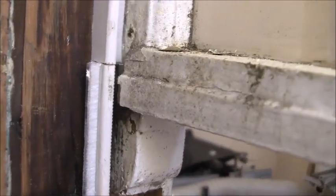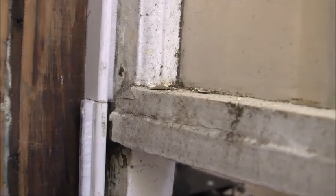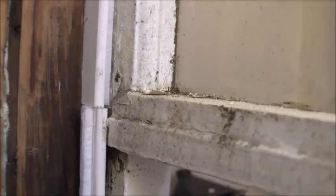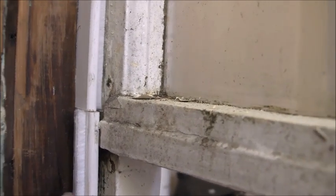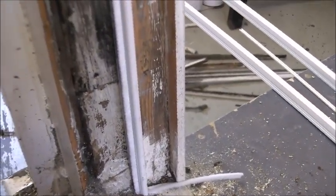Okay, so the lower parting bead is in. You can see its little tail there. It's in tight. At the moment, there's a slight mismatch up here. What I will do in a moment, I will pin these so they'll be in line. But should they ever move across, you can then see the potential issue with this brush being able to perhaps slide out if it wasn't held by having these tabs at the bottom. So that fold done, this one's exactly the same.